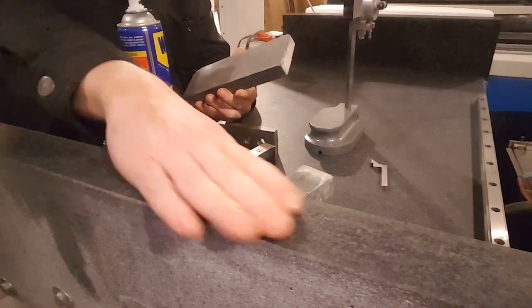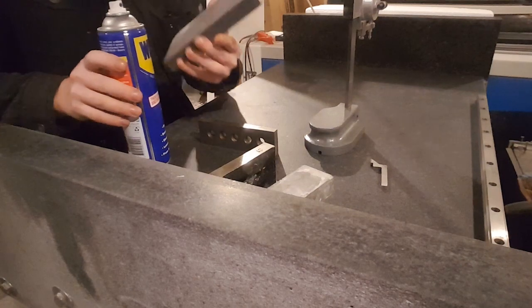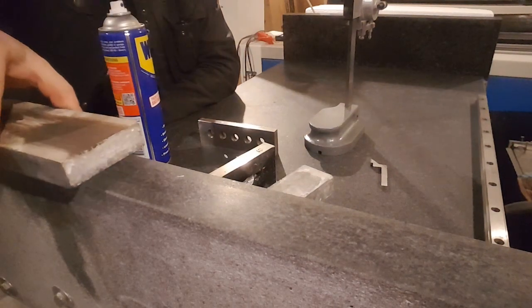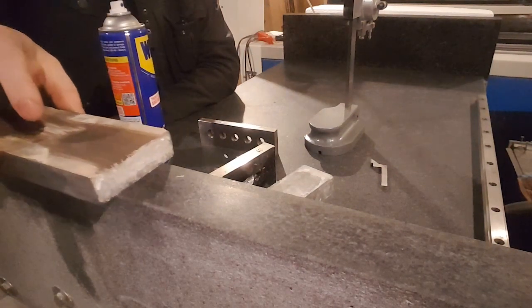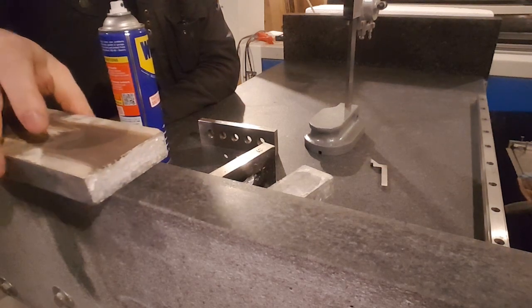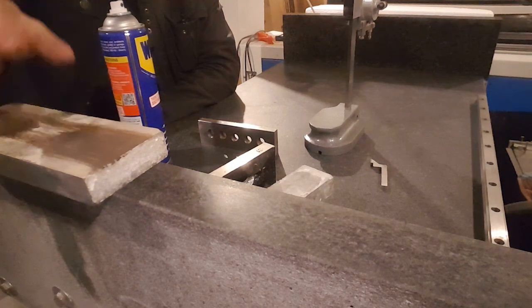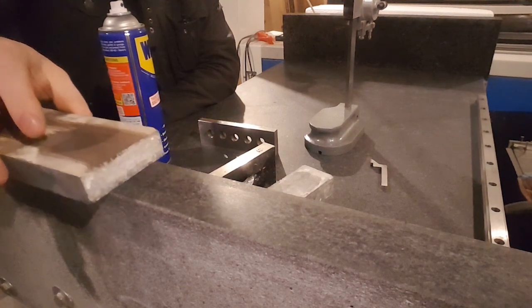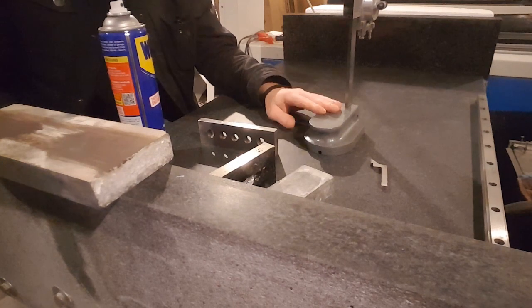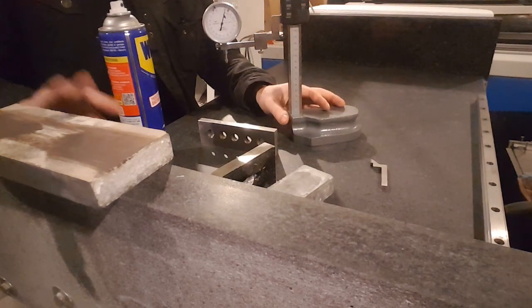I think that thing is already well ground, so I'm gonna destroy it — but yeah, you just go over and over. A couple of wiggles give you a micron down, so you have to be kind of careful and constantly measure with the dial indicator if it's there.